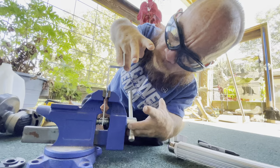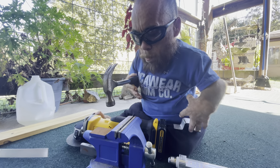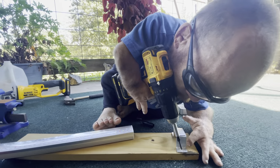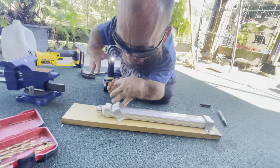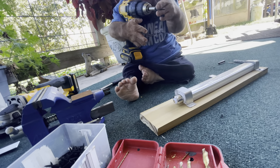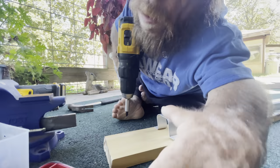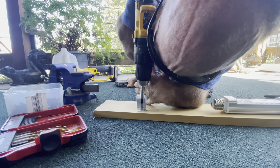I'm doing projects all the time in wood, but there's something about fabricating out of metal that I just really enjoy. One day when I build a shop, I'll have a room dedicated solely to metal work. So because I don't feel like digging out my Dremel or a grinding wheel, I'm just going to use my hammer and lightly tap over any sharp edges on these brackets. I'm going to use a metal bit to pre-drill these holes. Because I don't have any self-tapping screws, I'm just going to use a couple of drywall screws I have laying around. I decided to attach the bracket to the board before installing the light into the top of the enclosure — the shortest screws I can find are an inch long, and since my PVC is a half inch, I didn't want the tip of the screws sticking out into the enclosure. Also, the heat panel I just installed is roughly an inch thick, so by spacing the light the thickness of this board away from the top, I'll ensure the heat panel isn't preventing any of the lumens from reaching all the way down to my plants.